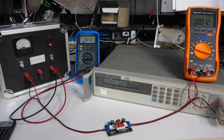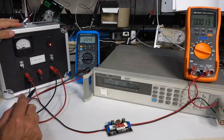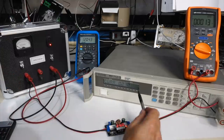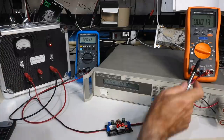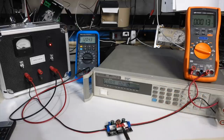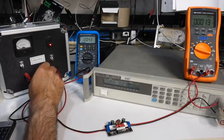All right, since I have been a sponsor to the tune of $12, I thought I would do my $12 of work and actually check if that little supply can actually do the 100 watts it was supposed to do. So here I have a 12 volt power supply. They say that you need at least 12 volts to achieve 100 watts. Here I have my electronic load currently at zero. I put a meter on here to get the actual current. The voltage, we can reasonably read it over here, it's pretty accurate. And here we read the voltage on the supply.